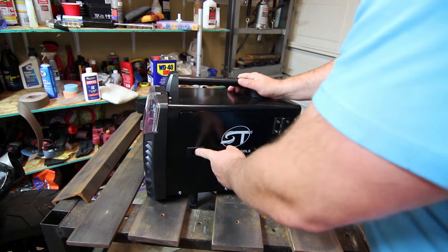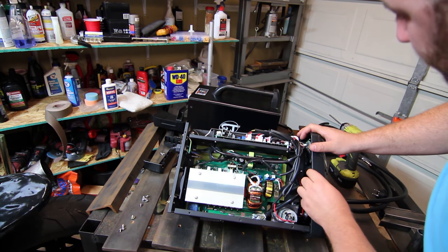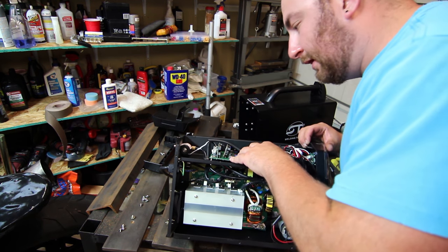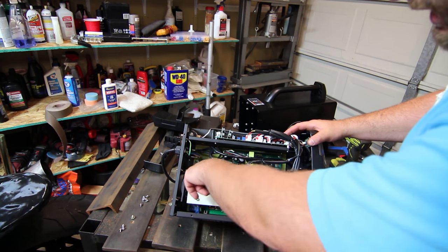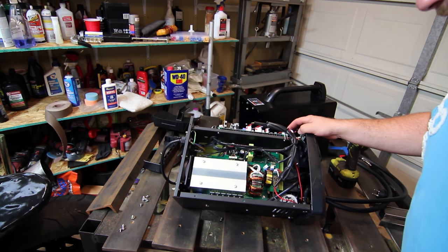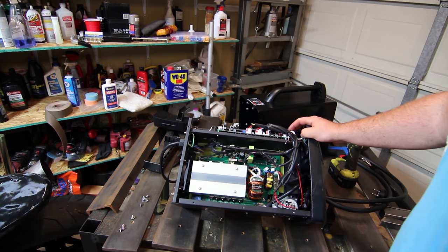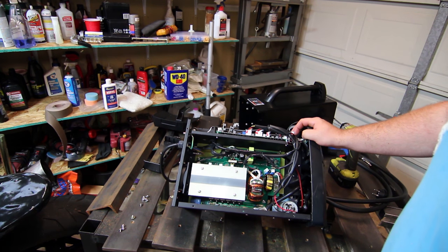The inside guts of the machine are actually pretty decent. Everything is heat shrunk, it's got a temp sensor, all the wires are carefully routed. There's a little bit of the traditional hot glue left by Chinese factories, but all the IGBTs are nice, everything is routed nicely, the solenoid is good, the hose is good quality, and there's a giant heat sink over the capacitors. The copper leads are a good size. The boards are well made — all the connections are nice and firm. The inside of this machine leaves a much better impression than the outside.